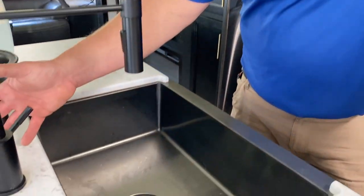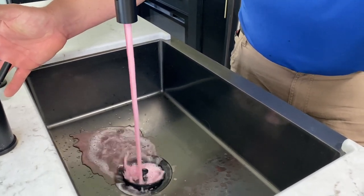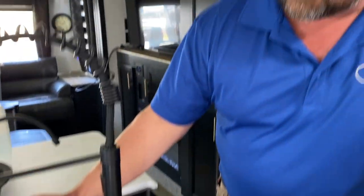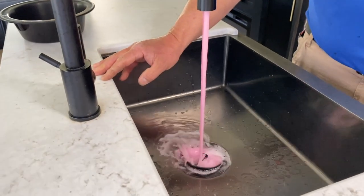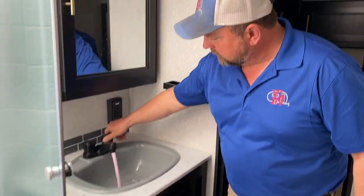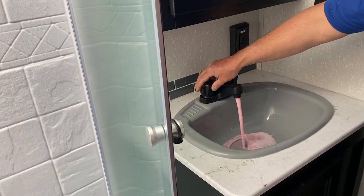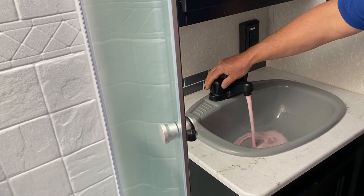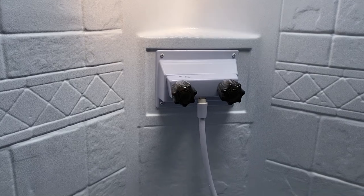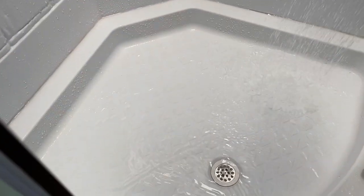Now that we're inside, come to the kitchen sink. We're going to turn on the cold — you see all the lovely pink — and we'll just let that run until it's clear, then kick it over to the hot side and do the same thing again. Kitchen faucet's done. Come to our bathroom and do the same thing. Remember to do both the hot and the cold side to get all the antifreeze out. There's no worries if you don't get all the antifreeze out of the line — it is a non-toxic formula and it is completely harmless. It won't hurt you.